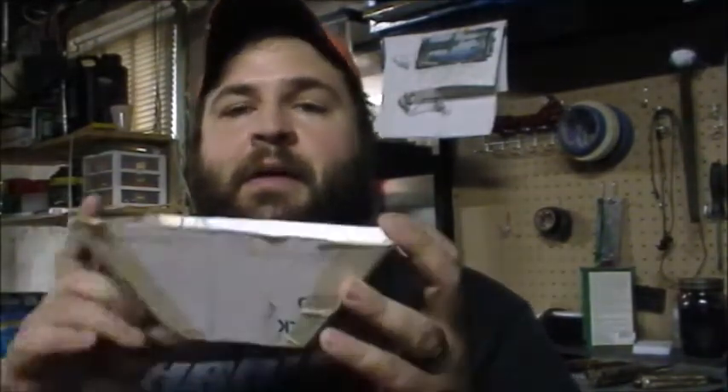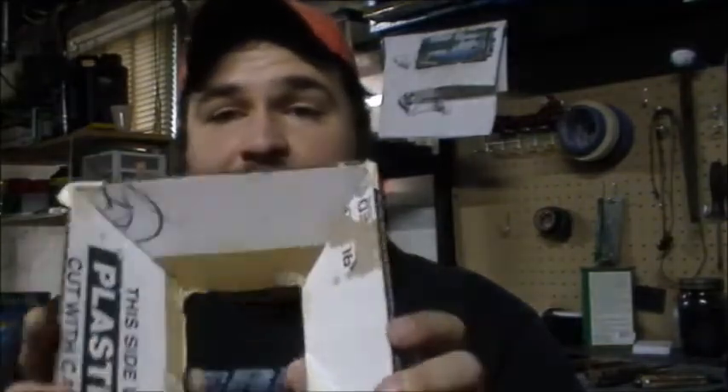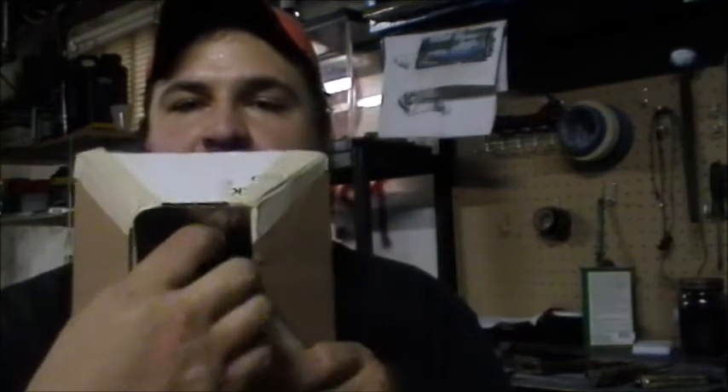I didn't want a traditional big fire pot because I work mostly small stock at the house for various projects, but I wanted the option of making it bigger if I wanted to. So I came up with mine being seven and a half by seven and a half, four inches deep — a perfect square. The bottom part is three inches because I'm going to be using a two-inch air pipe, which gives me a half inch all the way around.